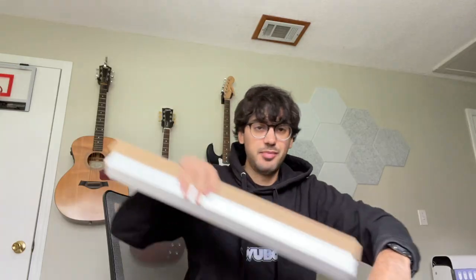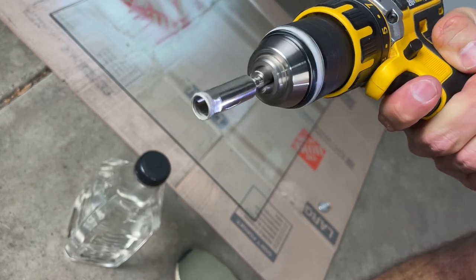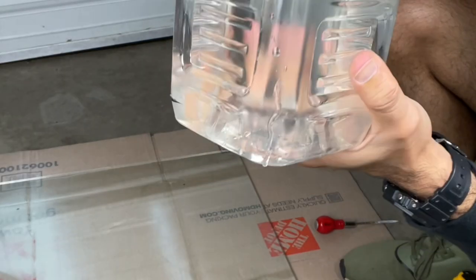This is the final step. This is just a big piece of glass I bought on Amazon — I think it's meant for tabletops. This one is 24 by 24 inches. The hard part is going to be drilling holes into this glass. I've never done it before. I centered the glass on the table, marked the spots with a washable marker, then got my drill ready. I bought these special diamond tip circle bits on Amazon. I also set up a high-tech cooling rig — basically you fill up a jug with water, poke a hole near the bottom, and when you unscrew the cap slightly, you get a nice flow on your drilling spot to keep things cool. Everything was going great, until...